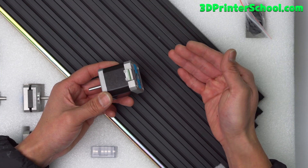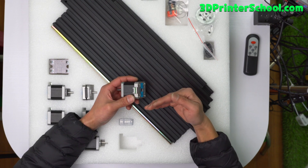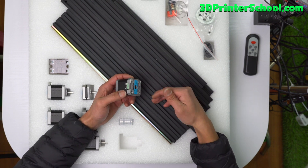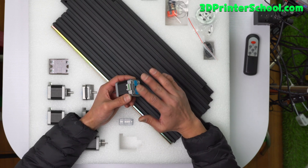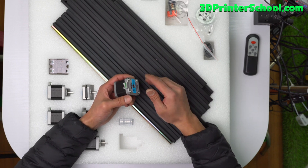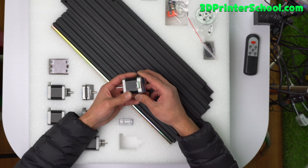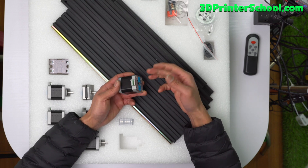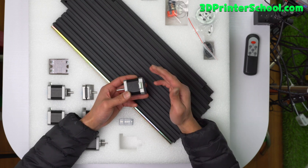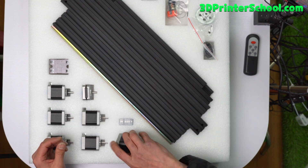When you go that fast, you're not really printing at quality. My whole goal here is to build a Voron — for example, I have a bunch of Prusas and I print multiple objects at the same time, and my top layer is not as good when printing multiple objects. That's where the Voron comes in, where the input shaper and pressure advance will help you print multiple objects with a lot more higher quality. So that's why I got the Voron.